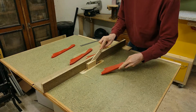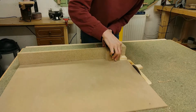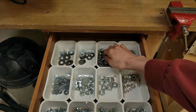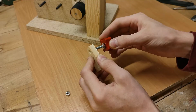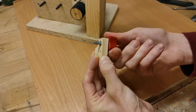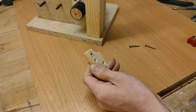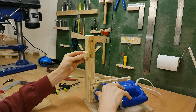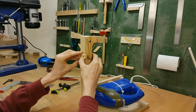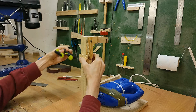You could either make the belt tensioner from hardwood and cut the threads directly into the wood itself, or use softwood and insert a screw nut. That's what I'm doing, since softwood is just so much easier and cheaper to get than hardwood, even though most of my hardwood was originally firewood which I got for free. Now I just need to screw it on there and I'm simply going to eyeball it to line up with the straight portion of this lever, using the square to get it straight as well. Then just clamp and screw it down.